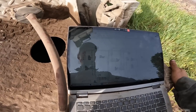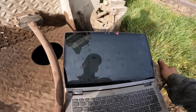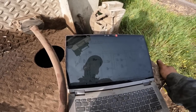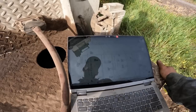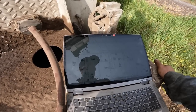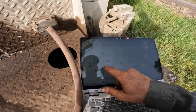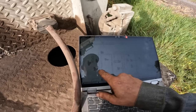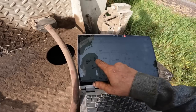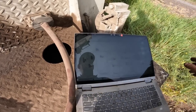So why are these freaking idiots using this? This is really familiar, because years ago I had a 9320T and the operator would be going down the road in that big tractor and it would go into park. And we ended up having to change the starter on that pile of shit to get the damn thing to quit doing it. I finally traced it down to the park brake enable relay, and it was set up just like this. And the damn thing had a bad starter, and the starter was causing all the problems with the park brake latch relay.